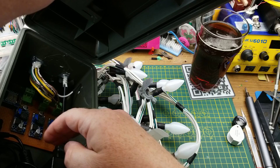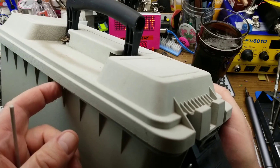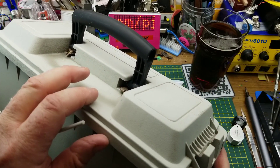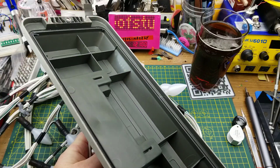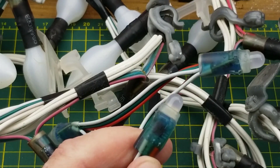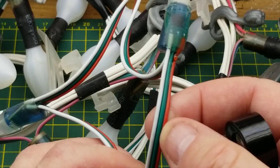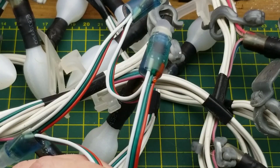There are three buck regulators and just an old laptop power brick inside this weatherproof box — which yes, it is essentially an ammo can. You can see that it has been sitting outside for several years because the outside is a considerably different color than the non-sun-faded inside. Each individual LED or pixel looks like this when you get them — they come in strings of 50, and you've basically got three wires: power, ground, and a signal wire, just like any WS2811 or WS2812.